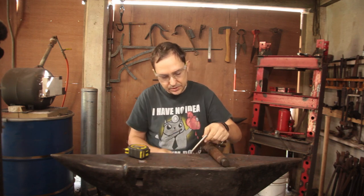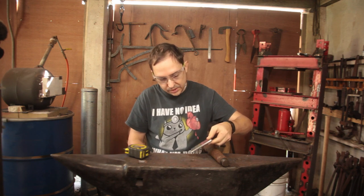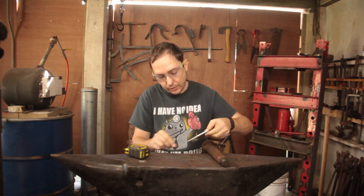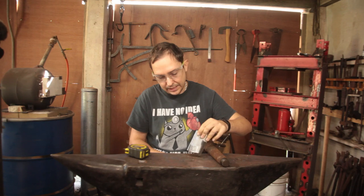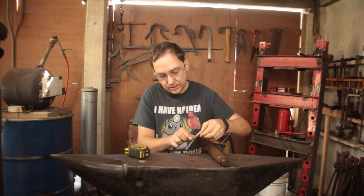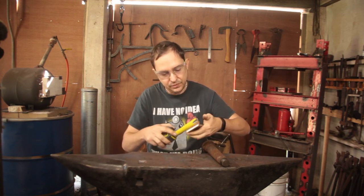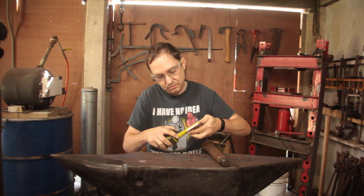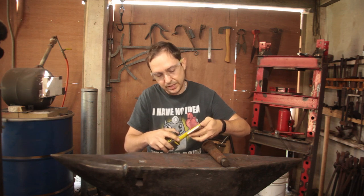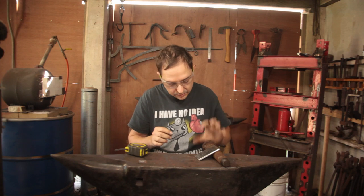We're going to use a piece of modern leaf spring for the face. So we'll draw out a short tang on that to give us a handle to hold onto it whilst we weld it, forge it to round, and that'll expand it out a little bit so we get the 60 millimeters. I think it's 50. Alright. It's just on 60 millimeters, so it's pretty much going to be what we need for that face. We might get a bit more thickness.